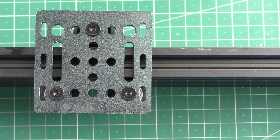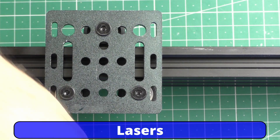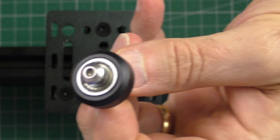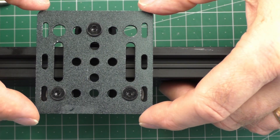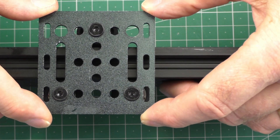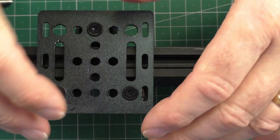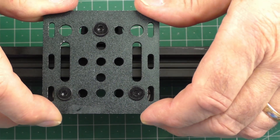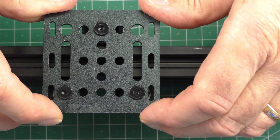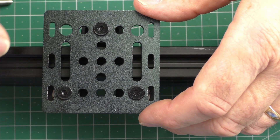Hello all and welcome back. Today we're talking about 3D printers and how to adjust these wheels because they're not all the same. If you're suffering from this problem, you can see I'm rocking it this way and now I'm going to tilt it this way — you can hear that's not adjusted properly. That will badly affect your print quality.